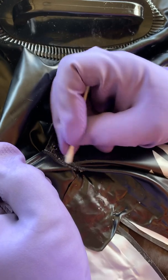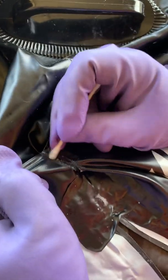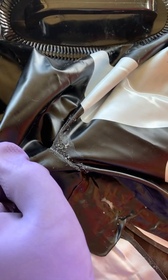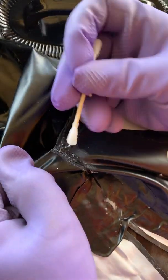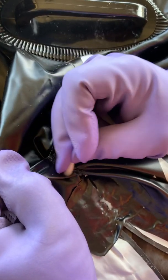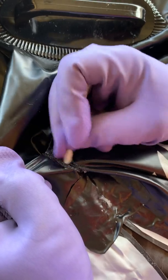Also, I've had pretty good success if you get glue on the outside of a shiny finished vinyl — the Toluene works pretty well to clean the glue without dulling the surface.